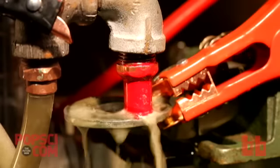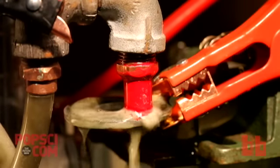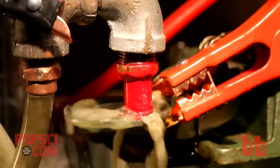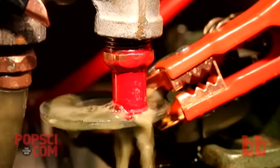When the earring is just the right distance away from the steel, maybe a couple of thousandths of an inch, the electric current that's flowing between the earring and the steel eats away the steel selectively. It depends on the direction that the current's flowing. If we ran it in the other direction, it would eat the earring and leave the steel in place.